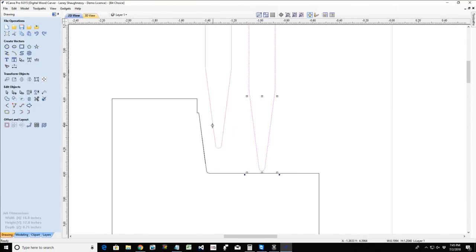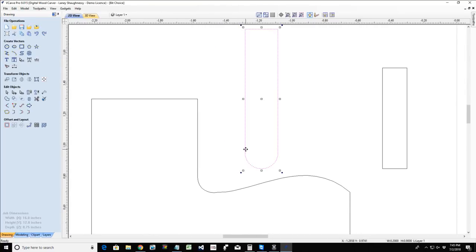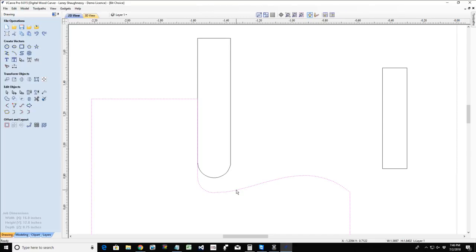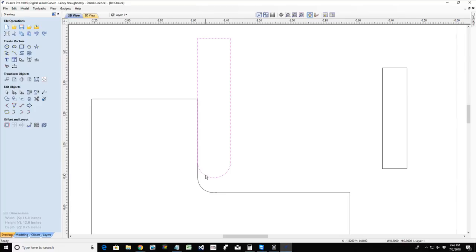So I generally always go for a tapered ball nose. The only time I would use a straight ball nose is if I want that straight cut with a ball at the bottom. And generally, if I'm doing that, then my cut has a flat bottom on it, almost like a bowl cut in a sense. I'm creating a flat bottom type cut where I want that straight wall and all, and that 3D finish.